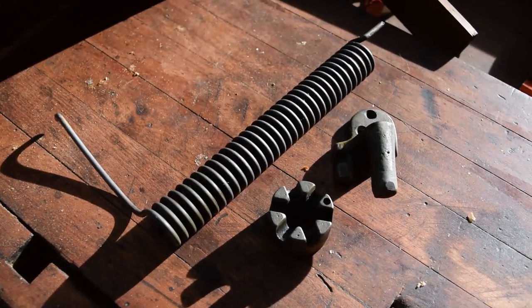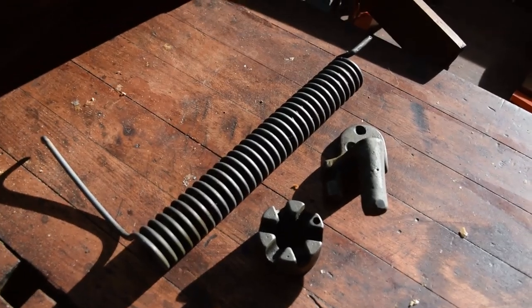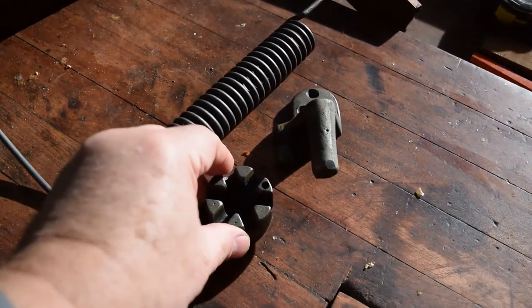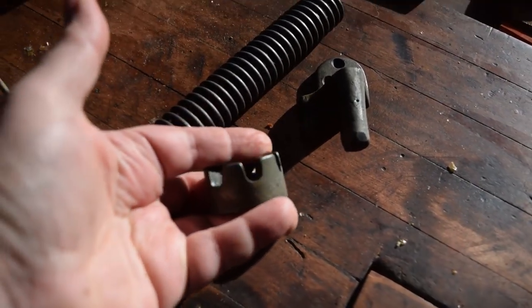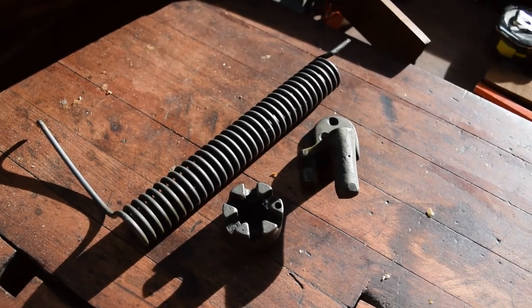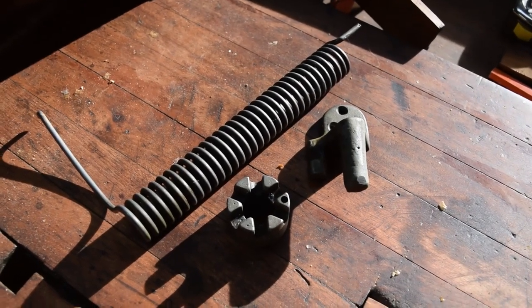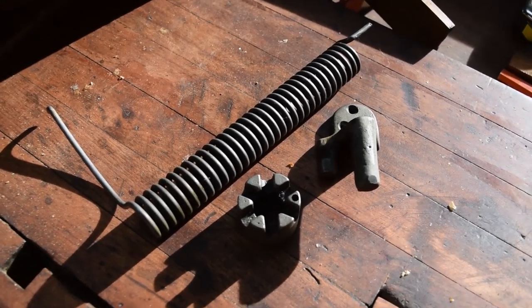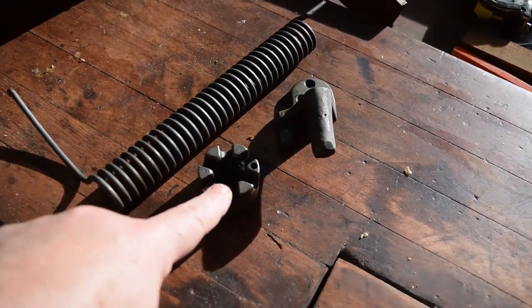And this is the spring assembly that assists the machine up and down in the cabinet. If you can remember, it was very, very rusty. All I did was take the pieces apart and soak them in vinegar, household vinegar, for 24, 36 hours, and then brush them off with some Scotch-Brite and rinse them in water, and they are ready to be painted. So that came out really well.